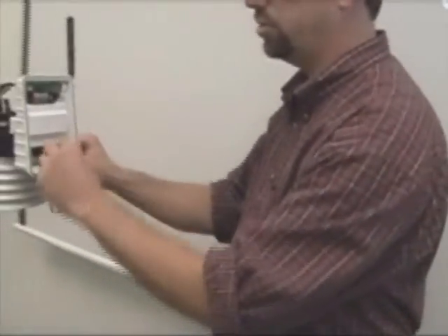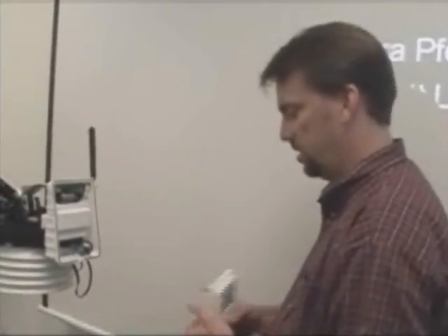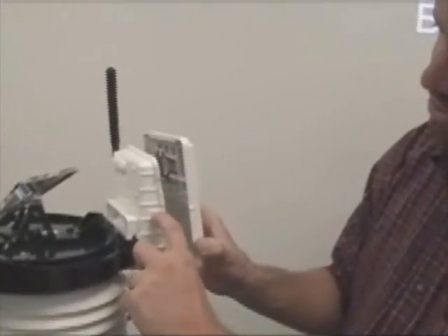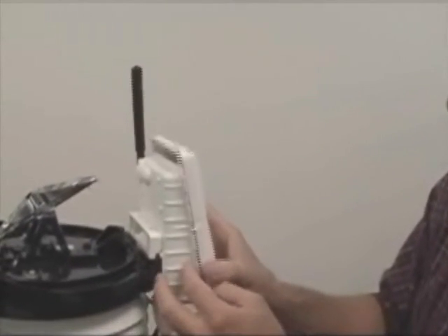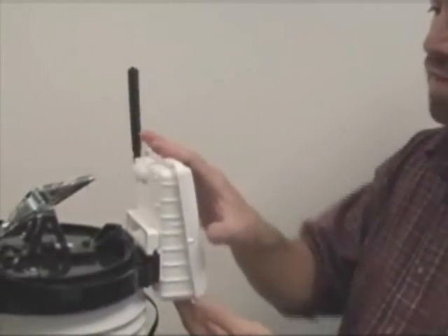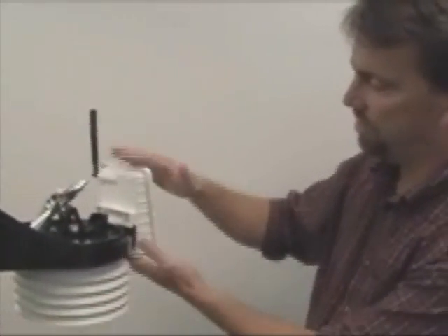Put the shelter door back on. Make sure you have your battery. Make sure the green light's not flashing — the fourth DIP switch is down so we're not keeping that green light on. Attach the solar panel and slide the door back on. There's a mark on the side of the door that matches up with a similar raised mark on the shelter; if you align those up, the teeth will fit into the door easily. Make sure you hear a click at the bottom and the door is on all the way. Look at the back — make sure the door is flush up against the shelter and down all the way, so it seals the shelter and keeps water out.